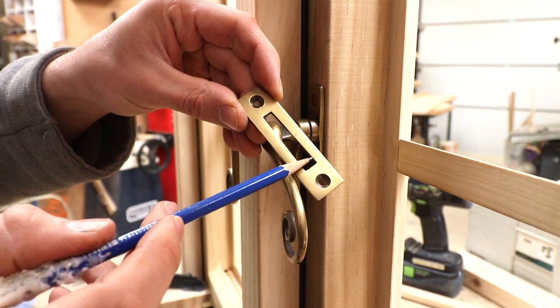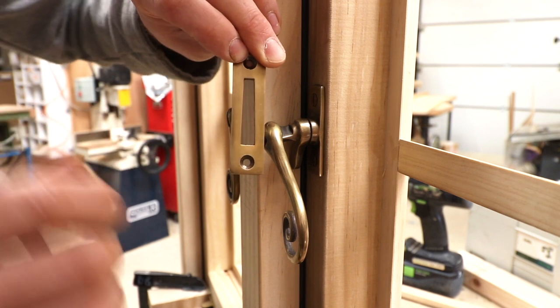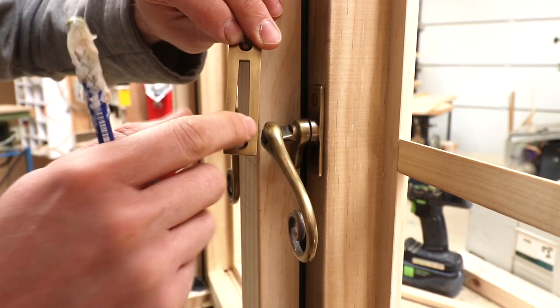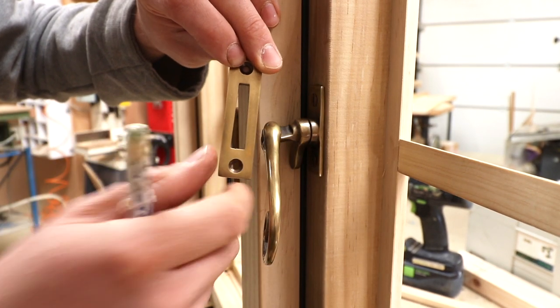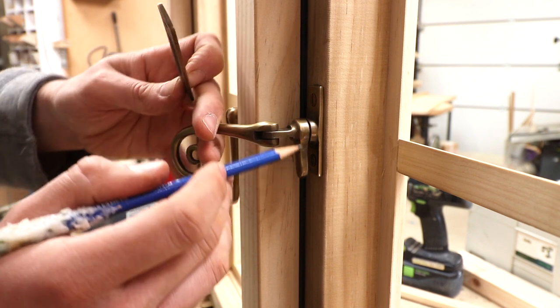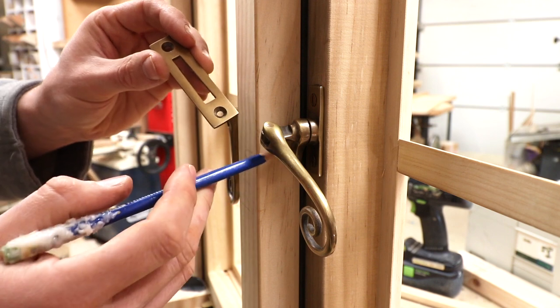From that point is where the bottom of the fastener will engage in the bottom of this mortise plate. These should have a slight bevel built into that slot so it's narrower at the top and goes this way around — so when that fastener engages at the bottom there it should be fairly easy to engage it with the seal open because you've got the slack of that fastener at the furthest point, and it's slightly tapered there at the bottom anyway. Then as you engage the fastener into the closed position this wedge shape pulls it in towards the centre of this wedge, which actually helps to pull the casement in too.